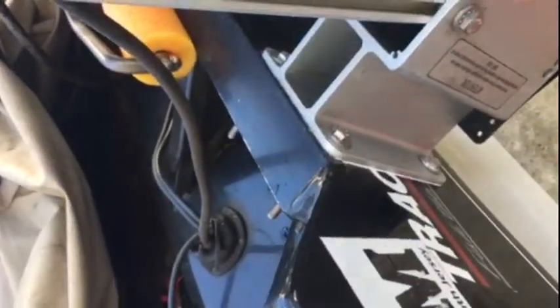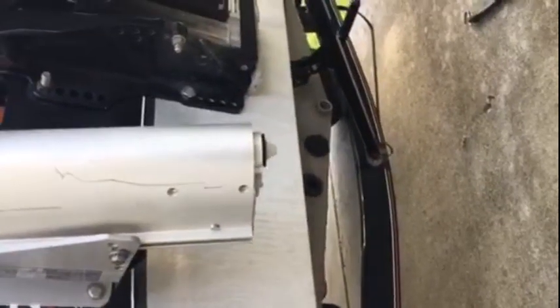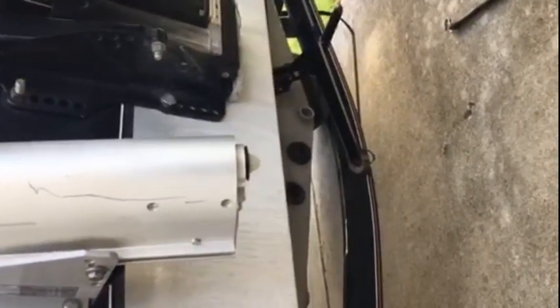As I said, we did reinstall it — the pin is in the middle position now, as opposed to before when it was on the very end, which would not let this piece go in all the way. We were able to stand the unit up. We have to adjust these metal bars so they fit loosely inside the loop and slide in, then we tighten them down. They do have a stop — we put it in where it stops at the depth of the bottom of the boat, so when the anchor goes out it's below that level.